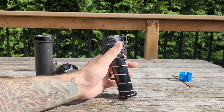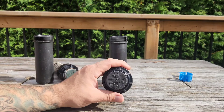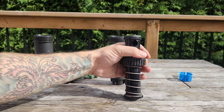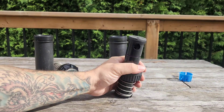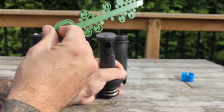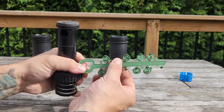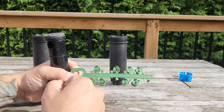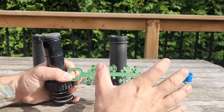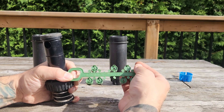We're going to focus on the first generation for our nozzle demonstration. The nozzle change on the 5000 Plus is very similar to every other modern rotary sprinkler. The easiest way is to take the cartridge out of the case. On a brand new rotor, there's obviously no nozzle in there. Rain Bird nozzles come on a tree. You want to select the nozzle that best suits your application — a quarter circle would be about 1 or 1.5 GPM, and a half circle can be anywhere from 2 to 3 GPM, depending on your area and zone layout. Today we'll go with the 2 GPM nozzle.